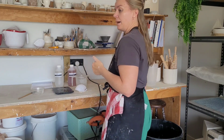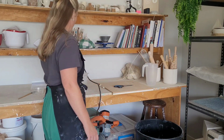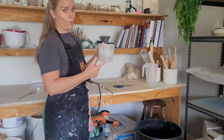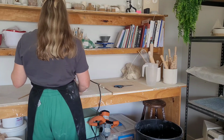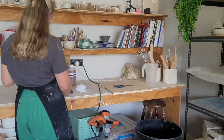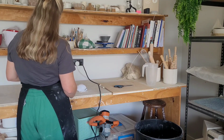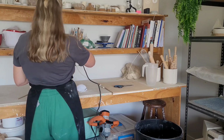While I let that slake for 10 minutes, I'm just going to get my Dispex ready. So I've just put in 200 grams of water. Never put Dispex in directly. That and sodium silicate, you want to dilute it in water and pour it in. So I've got my little measuring thing here. I'm going to put it on and then zero that out. And we want some Dispex, and we want 40 grams so far, and we'll go from there, seeing how much Dispex we need to add in later. Yes, 40 on the dot.